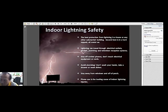A comment from Bani. Number one, what is the minimum distance of the two ground rods, sir? These ground rods should be bonded to other ground rods within the building. Yes, of course. In the passive type lightning protection system, I mentioned, say it's an elongated building. If you have so many terminals at the top of the building, on both ends, maybe left and right ends, well, you would have at least a minimum of one ground rod on each end.